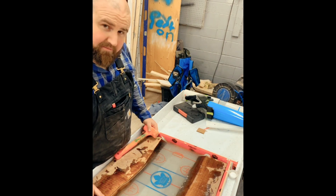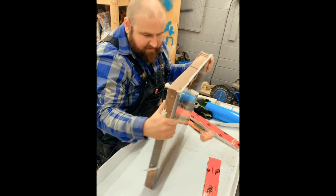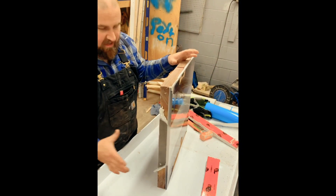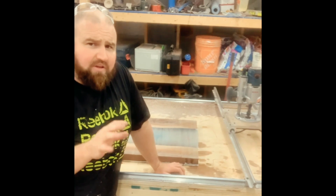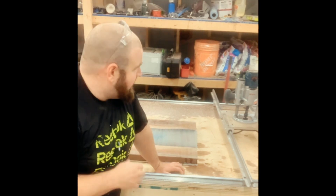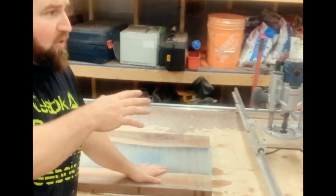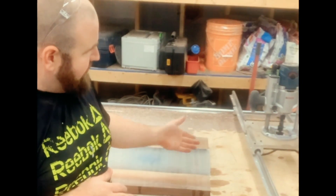The center fully cured at about the 12-hour mark — you can tell by the lighter color — and then the whole perimeter took another 24 to 48 hours to cure up. The center is a very different color and it's really got a ton of bubbles. We'll take it out of the mold, put it on the table, let it cure for a couple more days. That's the beauty of these molds — they just come out so easy. I use a router sled with linear rails to mill it flat; I'll do a more in-depth video on how I make that and how you can make one at your shop.